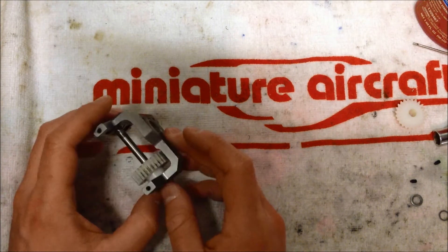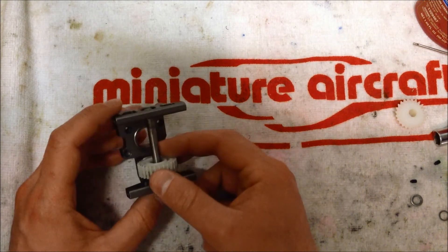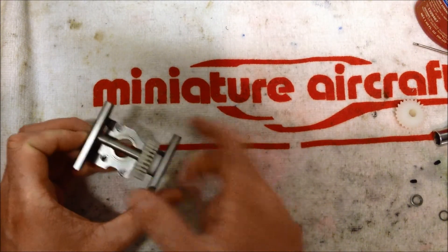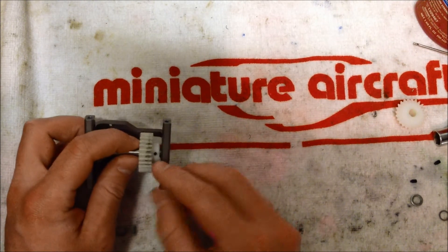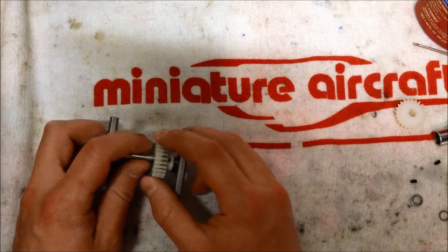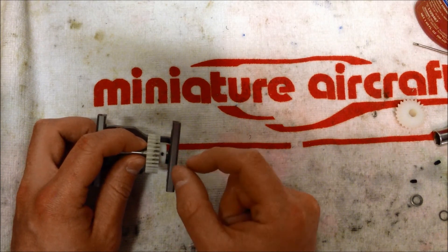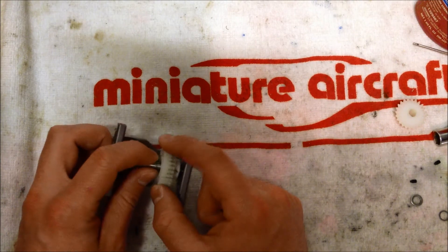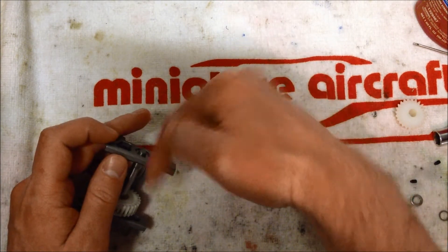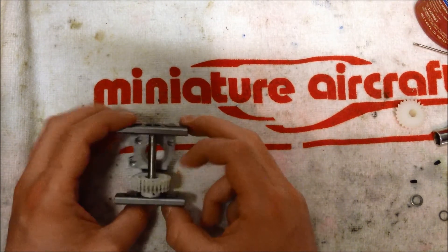It's pretty straightforward getting this whole assembly apart. The only thing I really want to point out is to push the jackshaft out downward. The reason for that is if you push it the other way, sometimes Loctite can wick down past the set screw onto the shaft between the shaft and the sleeve, making it difficult to separate. Also, sometimes when you thread the set screw in and it doesn't go in perfect, it can create a little burr, making it tough to get the metal sleeve to break loose. Pushing it out downward keeps the sleeve pressed against the bearing so it can't come out of the gear.